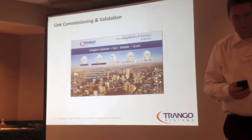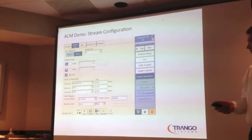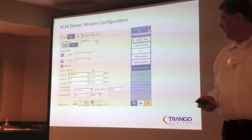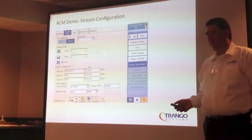Sure it all works, right? Right. So this would be an opportunity when you could pull out your Ethernet tester, your XFO. Remember, we did this yesterday, so I'm not going to do it again. But do some kind of testing on it here. You could send a fixed number of packets.